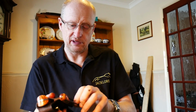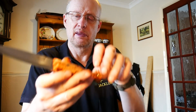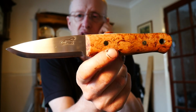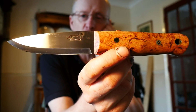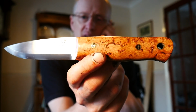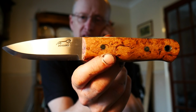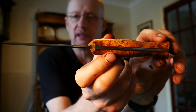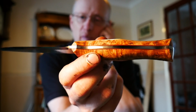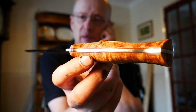This particular knife, as I say, is 3mm. And I've actually produced a shorter blade. This is a 3mm blade, a 4-inch long blade. Triple tempered, 58.5 HRC. And as I say, being 3mm, I don't tend to taper the tangs of 3mm knives. But you can see it's got red liners. Hopefully the light's picking that up and the camera's picking that up.